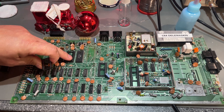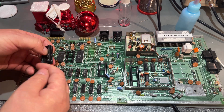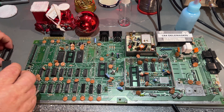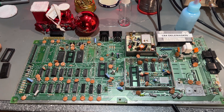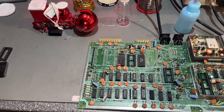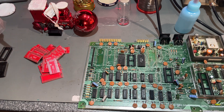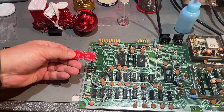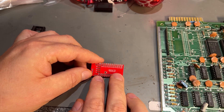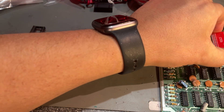One thing you can do is take a socket the same size and route the EPROM into it, figuring out which pins need to go where and then soldering everything together — but that is quite difficult. However, somebody else has already thought about that and come up with ready-made PCBs. These are ROM adapters you can use instead of making it yourself.